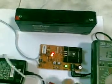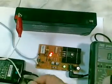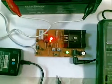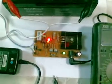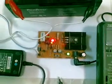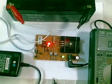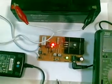Now I'm going to connect the terminal to the battery — the red wire to the positive terminal and the black wire to the negative terminal. Now you can see the red LED lights up, indicating the battery is currently being charged. Because of the small hysteresis of the op-amp, the orange LED lights up very dimly. When the battery is fully charged, it will switch from red to orange, indicating the battery is fully charged.